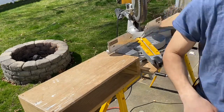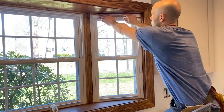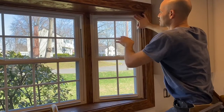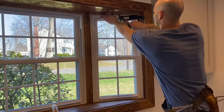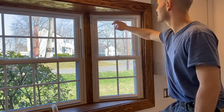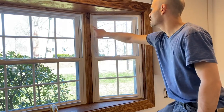So we got our piece cut at 20 inches. It's tight over here on the sill and a little slack over there, so we're going to just have to work with that. Put your piece in, put it tight. Generally what I like to do is put one brad nail directly in the middle — I'm using three-quarter inch brads here. This piece of wood is about a quarter inch thick so the brads grab pretty tight. Now I'll cut these two leg pieces — the reason I don't shoot those yet is because depending on the angle of that miter, nailing in here and here would lock the piece in and I can't pull it down or up to adjust that miter and make it perfectly where I want it. So always put that one nail right in the middle, then go cut the two pieces.